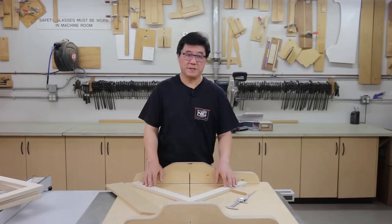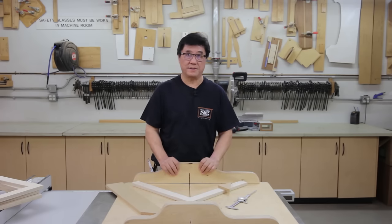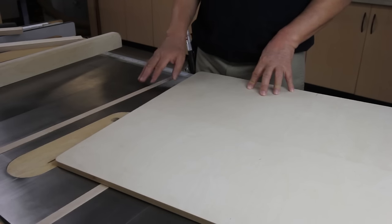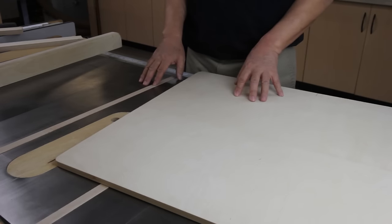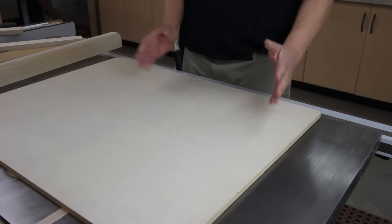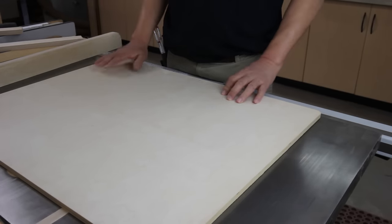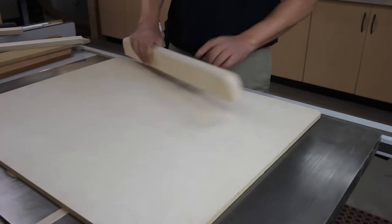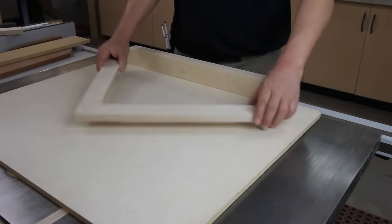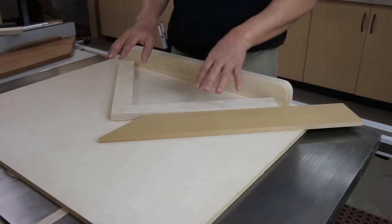Now I'm going to show you how to calculate and make the adjustment just in case the cut didn't come out perfect. I'm going to do that by making a totally separate dedicated miter sled, where my fence does not have a chance to be squared off with my blade. My runners are in place now — remember, the runners have to be perfect: not too tight and not too loose. I've shown how to cut them perfectly in my five-cut sled video. I'm going to place my base right in the center of my saw kerf — I'm cutting miters, so I don't need to offset my sled. I'm going to align it flush to the table back here, or you can put your table saw fence up here and align it to that. My fence will be flushed against the back.